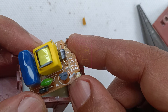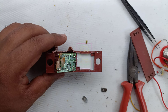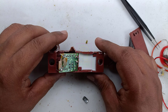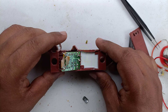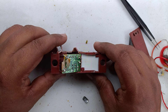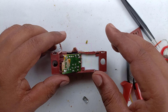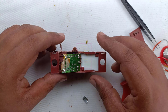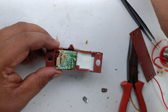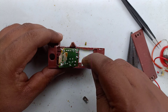For this type of circuit, the output choke will not be faulty most of the time. The faulty components are usually the transformer and the high-voltage capacitor — normally 0.47 microfarad, 250 volt. The reason the transformer becomes faulty is that the copper wire used in the winding is very thin, and when heat increases the insulation breaks down and causes a short. This is the normal cause of transformer failure.